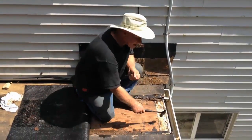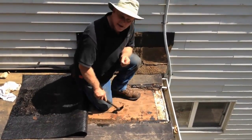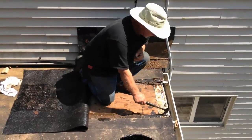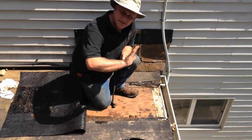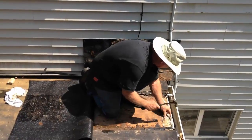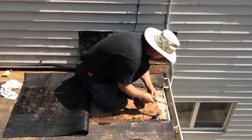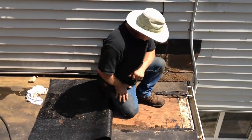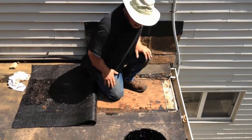I've lowered this and took all the membrane material away from the roof. I got about an inch of lowering, and I lowered the lip on this metal edging too — that metal edging also caused a lip that made water pond back. So I'm going to nail down the flashing here, and then cover this with membrane all the way to the plywood. We'll see how it works.